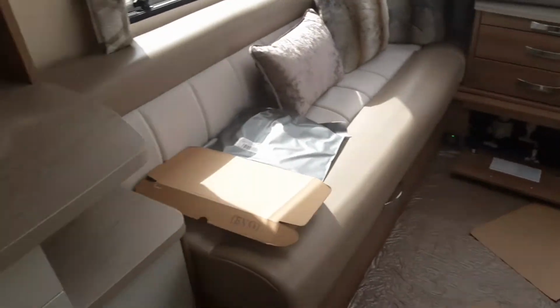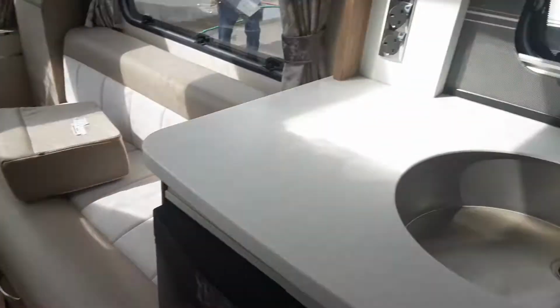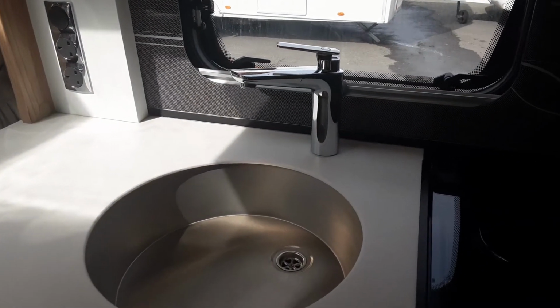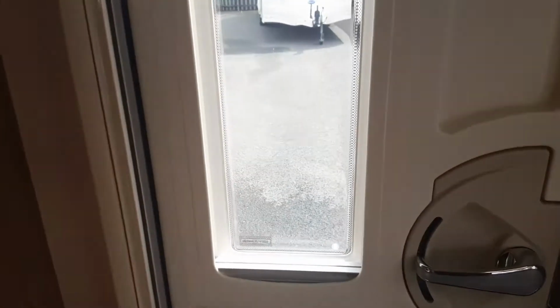Once you have these valves open, you can press the water pump button above the door. And when the water's continuously coming out of all the taps, you can go back over to the taps and shut each one down. You need to make sure you shut all three taps, because if not, the water's going to carry on running, as I'm sure you can imagine.